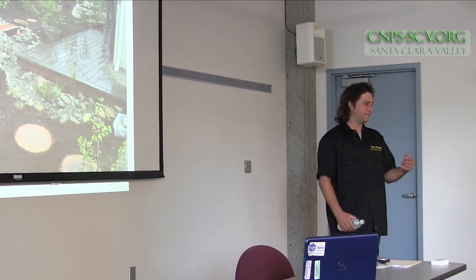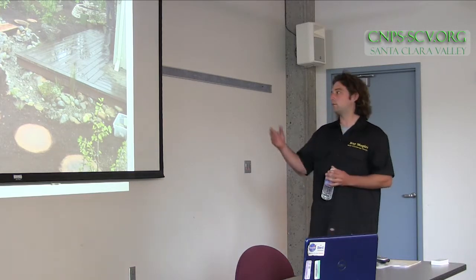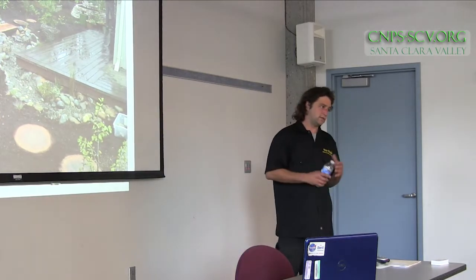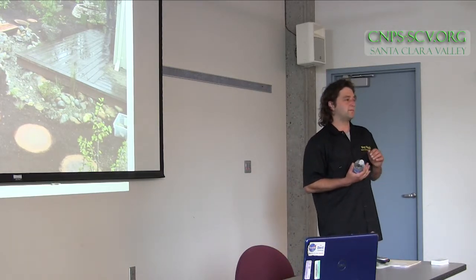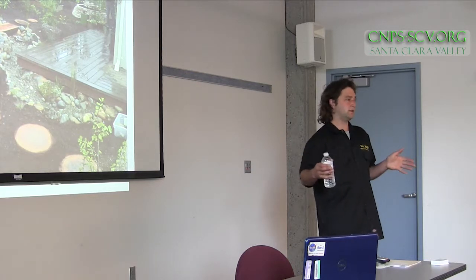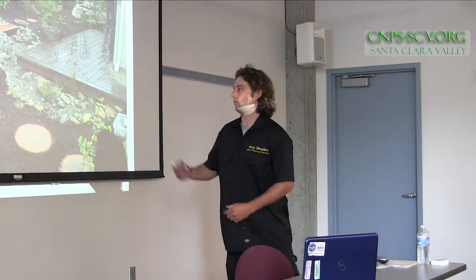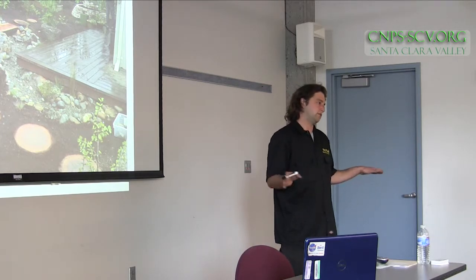You said you had some thoughts about termites. Oh, yeah, so termites. If you're concerned about using arbor mulch or whatever mulch you're using attracting more termites, a couple rules of thumb: keep as much woody material away from the foundation of your house, at least 18 inches. The gap between your house and where the mulch starts should be about 18 inches of just completely bare soil.